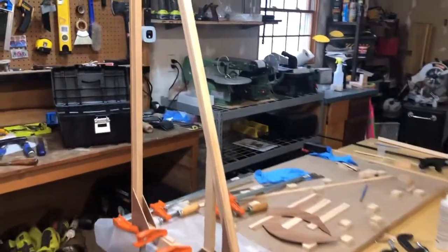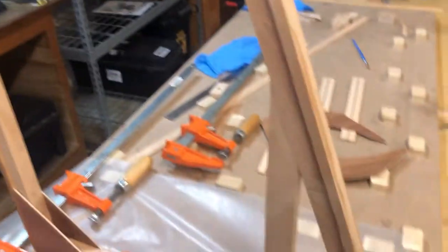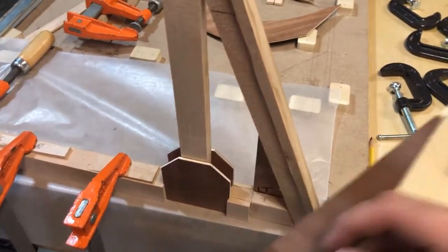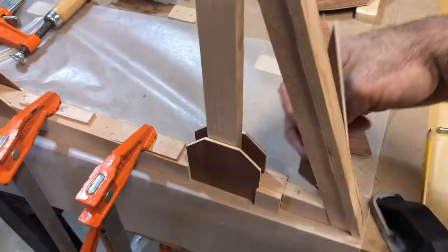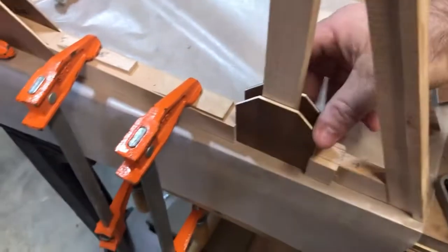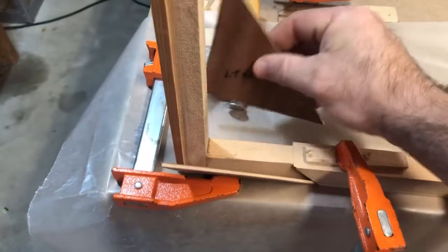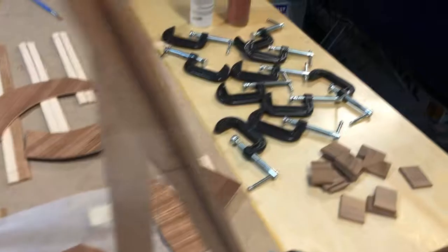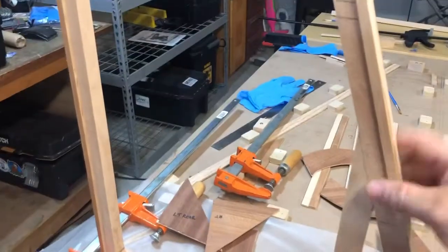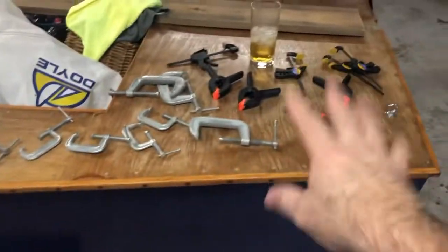Alright, so let's glue the rest of it together. The frame came out really nice and clean — popped right out. I finished today properly fitting the gussets to be ready to be glued and clamped on. So what we're going to do now is we're going to put the gussets in, the ribs, and the gussets on the top piece up here. We've got our clamps and glue.